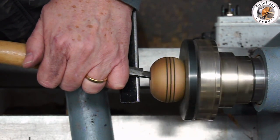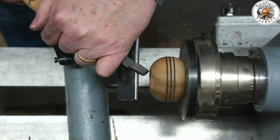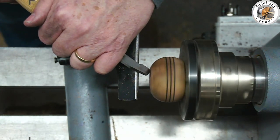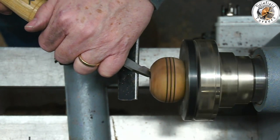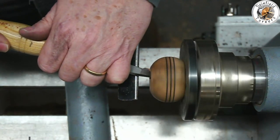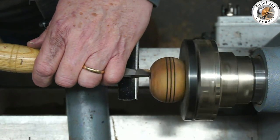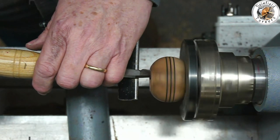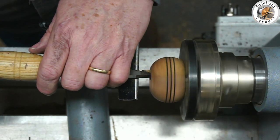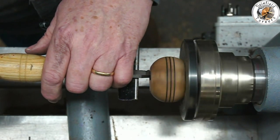Again 250 rpm — cutting point on the edge, start at an angle to get the thread chaser to pick up, with a very slight positive pressure inwards towards the cutting surface. Then rotate the tool so it's parallel with the axis of the cut and gently allow the thread chaser to pull the tool in and create the thread. Make sure you don't go beyond the recess, otherwise you'll simply turn all those threads off.